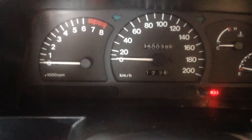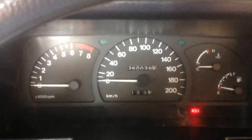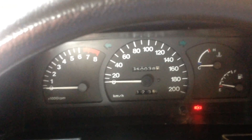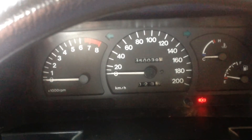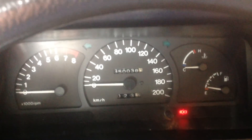I would like to be able to measure the cranking current, but I don't have the appropriate meter to measure that. I need an inductive DC clamp current meter and I don't have one — I'm looking. I'd like to know if it uses more than 200 amps at any point, which would be more than the safe limit for the supercapacitor pack to handle. From the reading I've done, the pack should be good for 200 amps for one second reliably — it won't damage it. You couldn't do it every couple of seconds, but it won't damage it in the long run. Short circuited, the pack could do about 1000 amps apparently for one second without suffering any damage, although that wouldn't be recommended in a repeated use situation.